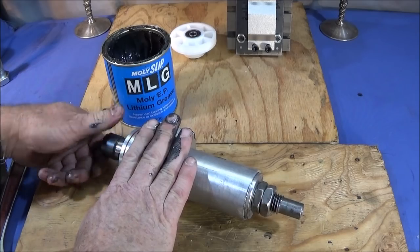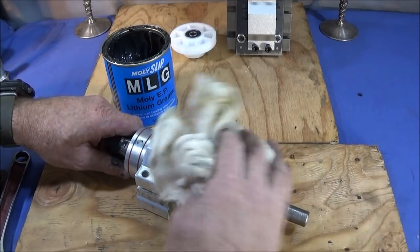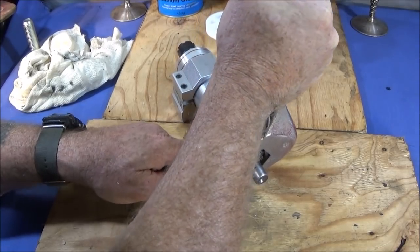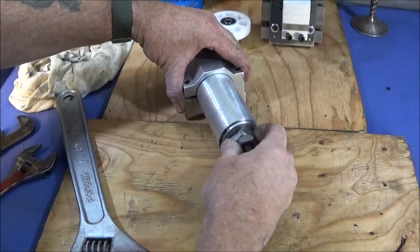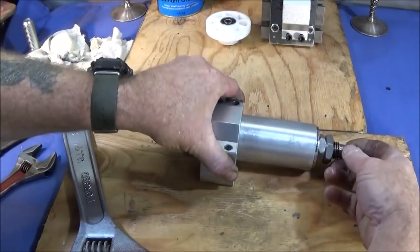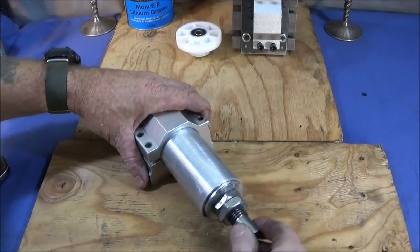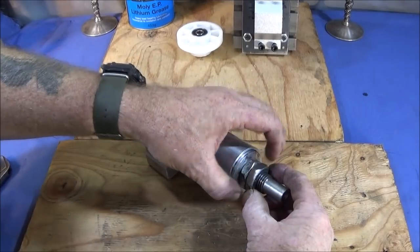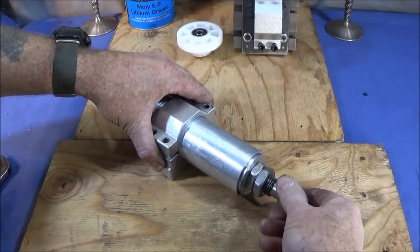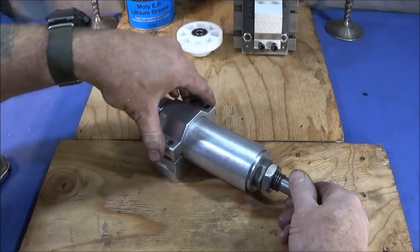But that feels really good. There's no movement in that at all. It was brilliant. And you do actually get a feel for the bearings. You've got to tighten the other one up like I've just shown there, lock it together, and then feel again that it's not too tight. That one feels perfect. So like I said, I like to do mine just up finger tight and then try locking up and seeing what it's like then.